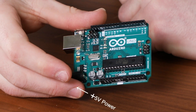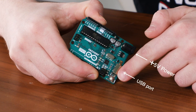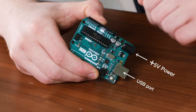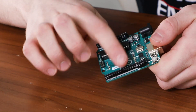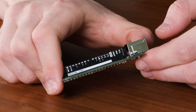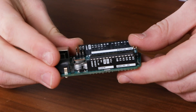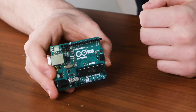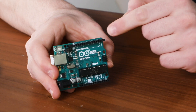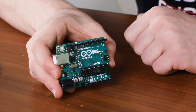So let's talk about this Arduino Uno for a minute. There's a port here for power — 5 volts is what Arduinos run on. There's a port here for USB programming. And then there are all of our inputs and output pins. On this side we have the digital ports and a few other ports we'll talk about later, and on this side we have the analog ports and also a few other ports we'll talk about later. This model, the Arduino Uno, has 14 digital input or output pins and six analog input pins.